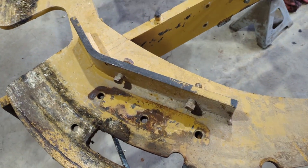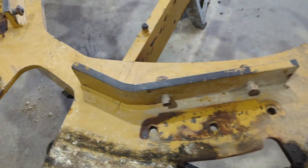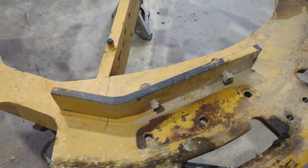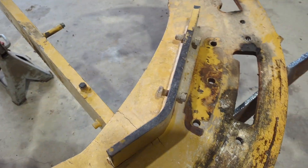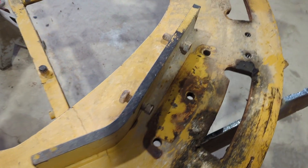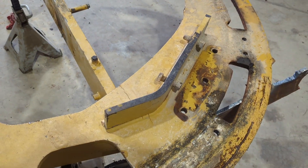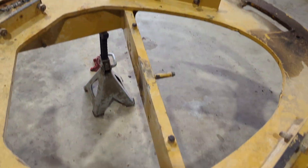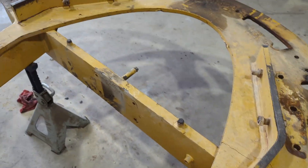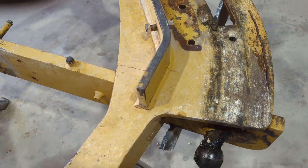Not really sure what to do or how to go about this. I'm gonna knock these plates off — measure and mark where these plates have got to go — then take the air arc and gouge them off the best I can. I'll try to keep them intact so I can get some made up to replace them.